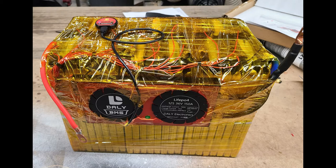It would have been $1,500 alone if we tried to series the 3 batteries, and that did not work out well at all. Even though they claim they can series up to 4 of them, what I found is typically there's an overvolt condition that ends up popping one of the BMSs. In our case, in the 36-volt, the center battery's BMS always got popped, rendering the battery useless, so that's why we cut them apart and did what we did.